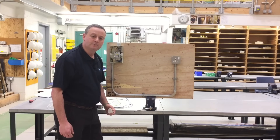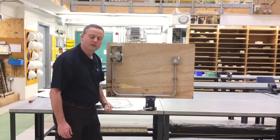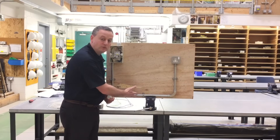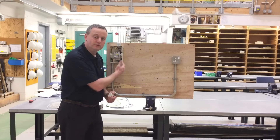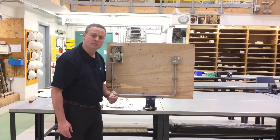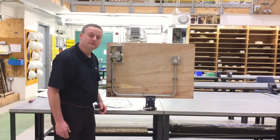Our installation has exposed conductive parts which need connecting to earth. If it's electrical and metal, it's an exposed conductive part — so the metal clad socket, metal conduit, and metal clad consumer unit are all exposed conductive parts requiring connection to earth. We also have extraneous conductive parts such as metallic water pipes, metallic gas pipes, and the metallic structure of the building. Whether these require connecting to earth depends on the edition of wiring regulations and whether incoming water and gas services are in plastic or metal.